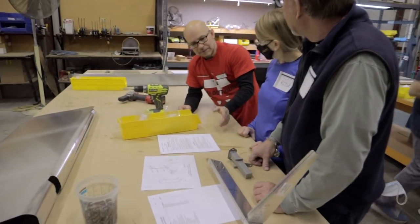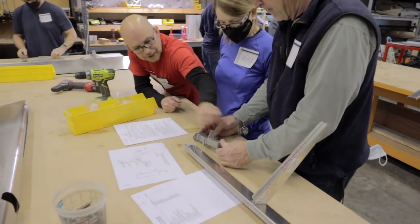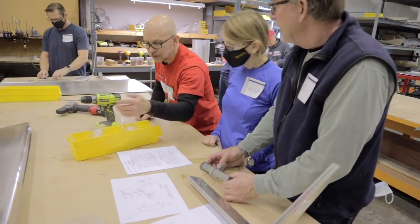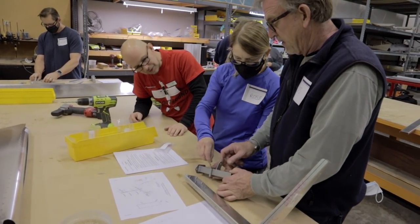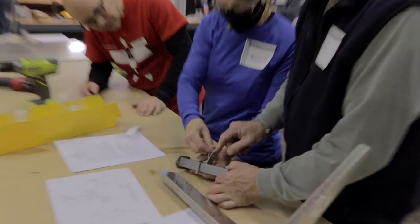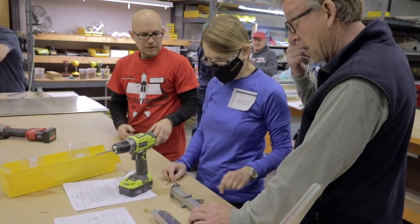So the first thing that we do is clean out the powder coat, because your bolt might not even go through that. So I'd clean this one, the middle one, and even this one, and these two down here. It's just powder coat that's gotten in there, and your bolt usually won't go through. I'd test the bolt and see if it does. We might be lucky that it does go through. In this case, it's only powder coat. It takes nothing at all. They're all number 11. This is a number 11 size bit. Every one of them is number 11.